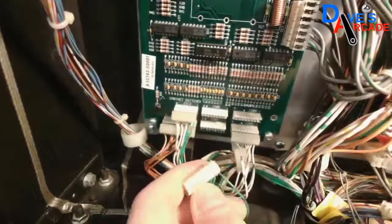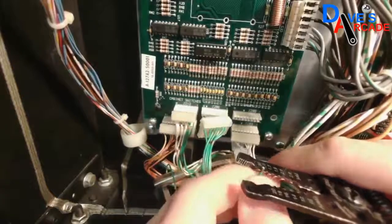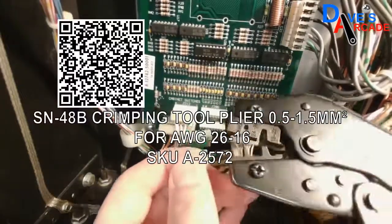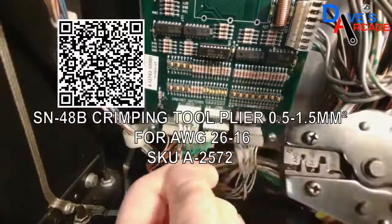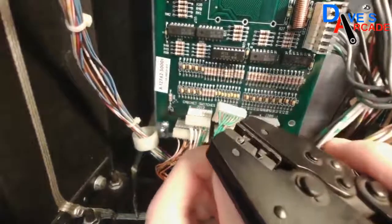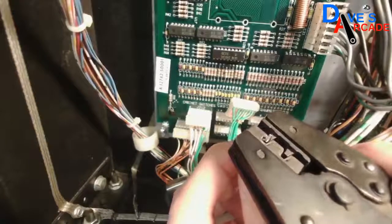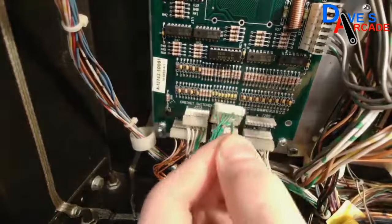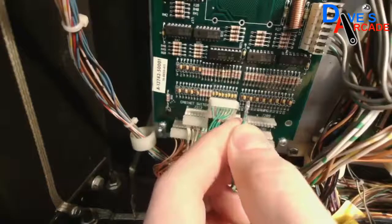Since this one has a cap, I'm just going to snip the individual wires off of the connector, and then I'm going to strip a little end off — you don't need much, maybe like an eighth of an inch. Then I take my ratchet crimpers, put the crimp terminal in the correct size slot, insert the wire into that space, and then I look for the wire on the other side. When you crimp it down you can see how it crimps both the insulated jacket and the stripped end of the wire.